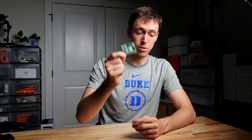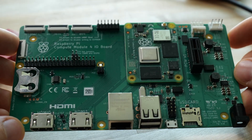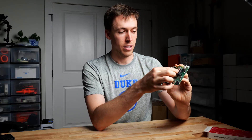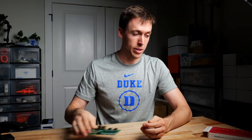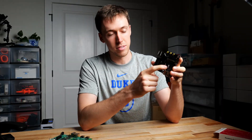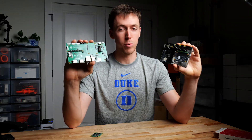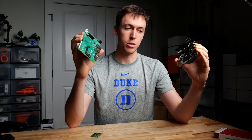If you're trying to flash a compute module with eMMC, you'll need a couple of extra things. First, you'll need your compute module and some sort of IO board — in this case I have the official Raspberry Pi Compute Module 4 IO board, which is a board the compute module sits on so we can connect to it. Other options include a 3D printer control board from Bigtree Tech, which has headers for a CM4. Note that depending on which IO board you use, one step will differ slightly between the two.